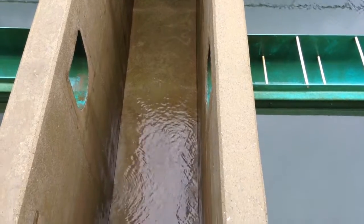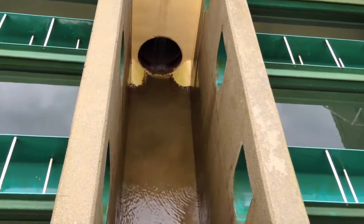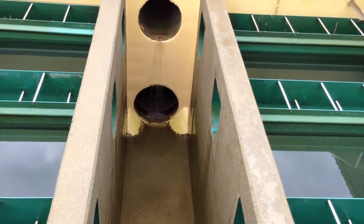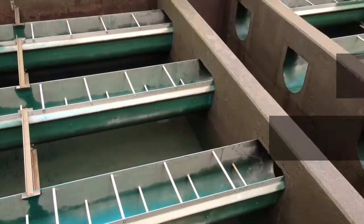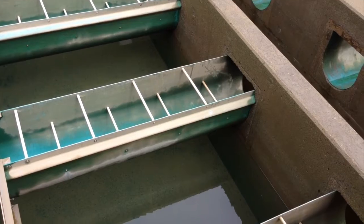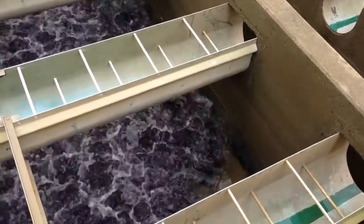Notice that the gullet is sloped and the water is collecting down at the bottom of the gullet from the other side. Right now we're in a waiting period because we're waiting for the water to go down through the sand and the anthracite and reach its drawdown level, which is close to the upper. We have the air scour just beginning.